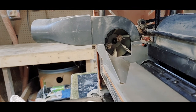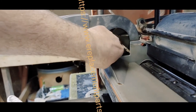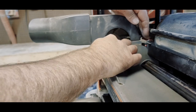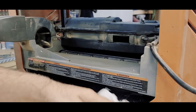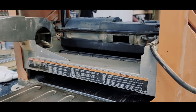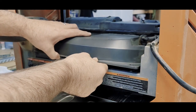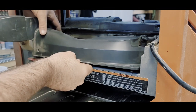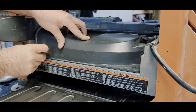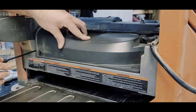Once all your blades are put back in, it's good practice to check the fan blade. I burned one up because I let the barrel get full, but you can get all these parts at e-replacementparts.com — I'll leave a link in the description below so you can check it out; they have all the parts for this planer. Now that everything's back together, put your cover back on, slide it in to engage that little switch, and put your bolts back in. Again, I like to start them by hand to help prevent cross-threading.